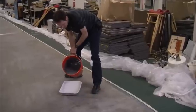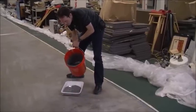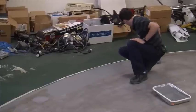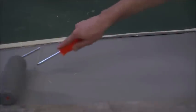Use a long-handled roller with an epoxy-safe 3/8 inch nap cover to apply an even coat of Epoxy Shield onto the surface. Apply in 4 foot by 4 foot sections so that the decorative paint chips can easily be scattered onto the freshly coated surface. Maintain a wet edge to prevent lap marks and gloss differences.